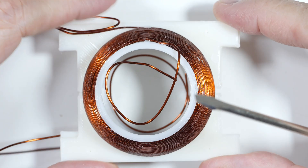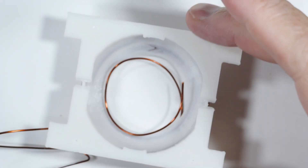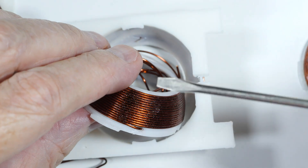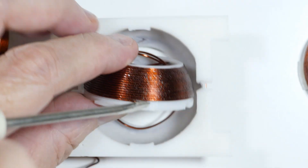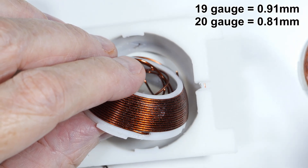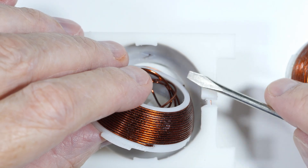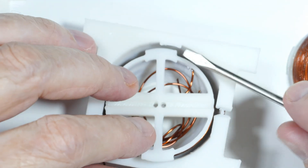This is actually a fully wound top and bottom external shell. One improvement I made during the winding process: before, I was drilling the hole straight through, but now I drill at an angle so the wire goes in smoothly — otherwise it puts too much stress on the wire and it won't lay flat. I've also switched to 20 gauge wire from 19 gauge, because 20 gauge is easier for most people to get and the 19 was frankly a little thick given the tight clearances between the outer shell and the inner ball.